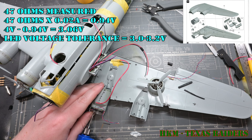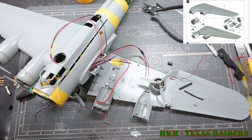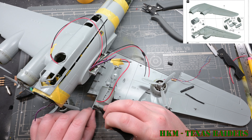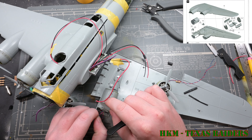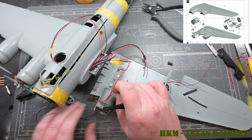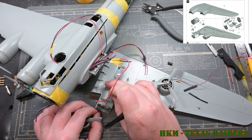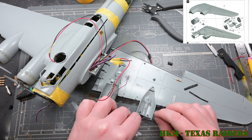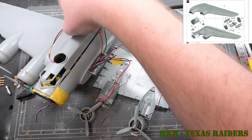There are a number of holes that need to be drilled — as with the right hand wing, we need to drill through the firewalls for the engine wiring to go through, then drill through the landing gear bay bulkheads to get access to the top of where the air induction pipe is. That lets us sneak the wiring in a way that can't be seen from the landing gear bay, all the way through into the wing where we can solder it to the wiring coming through the fuselage from the right hand wing.